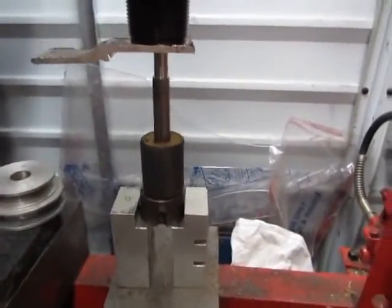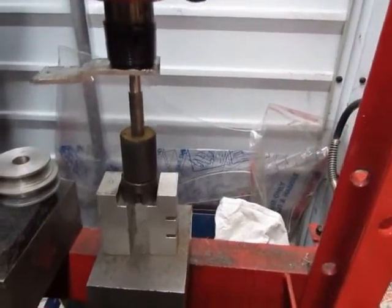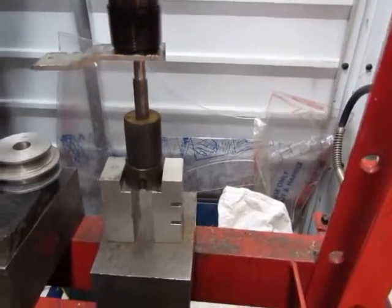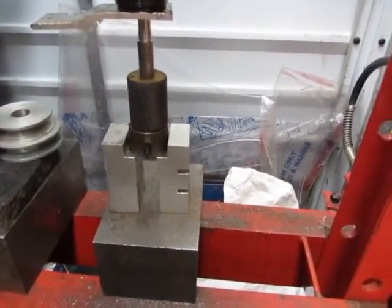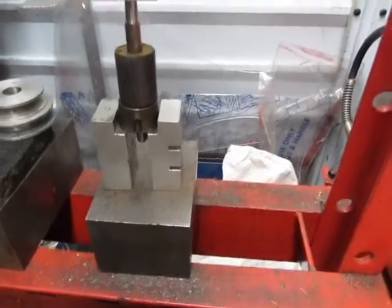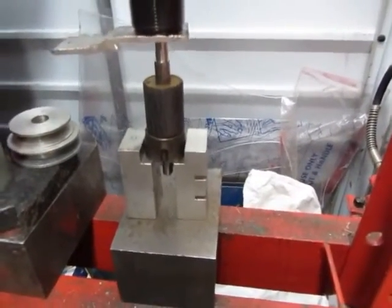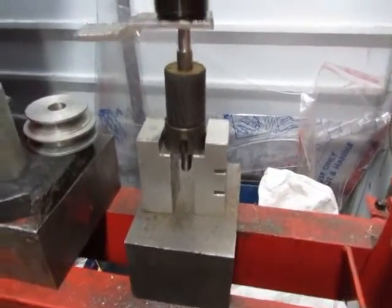Here goes — I lift this lever up and down, which generates hydraulic pressure. It doesn't require much force to push this through, but it comes through because there's a very tight interference fit. You should see it start to come through the other end. That's about as far as I want it, and you can see it's come through the other end.